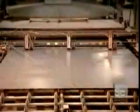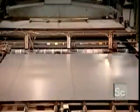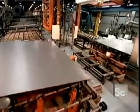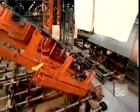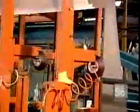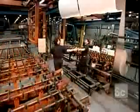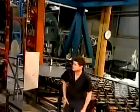Now the second coat of paint. There's no reason for the different color other than to differentiate the coats. This time, the curing period is twice as long and at a higher temperature, close to 245 degrees Fahrenheit. After an acid wash to remove any metal residues, they stand the panel upright to inspect it. If they find a fault, such as a bubble in the glass, they cut that portion out.